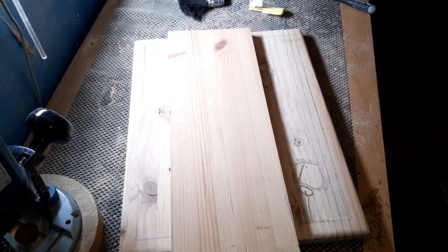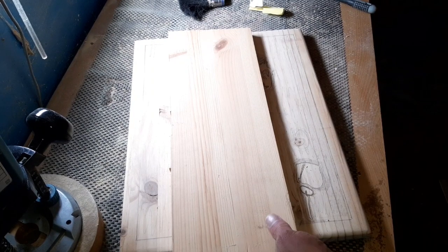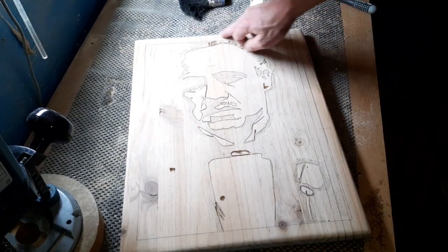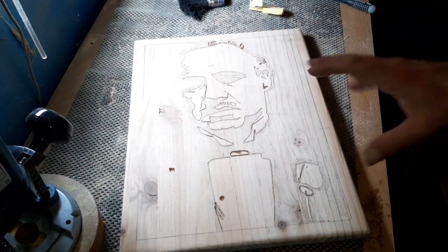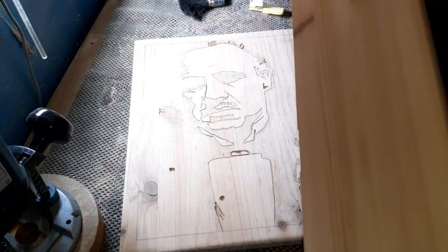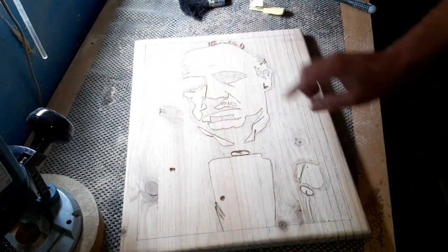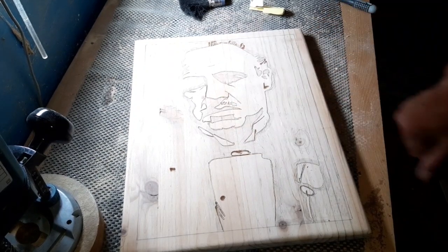For me personally I'm just going to do it freehand. It's not showing off — you can do straight lines with a router, I'm sure we all can. I'm just not personally bothered if it's not a perfect line. Sometimes it adds character if it doesn't look like it came from a machine. So if you're not comfortable and you're new, just get a nice straight piece of wood and make yourself a guide. We'll cut out this framework quickly and then come back to pop on the end milling bits.